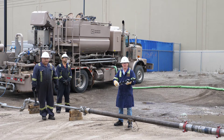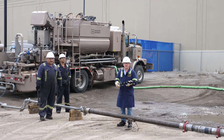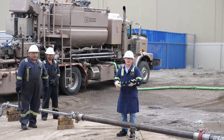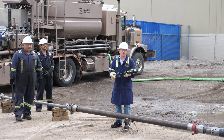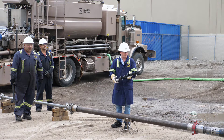So we're going to pump this typical wiper dart through our fixture. In our fixture we've got a couple of our Limitless frack sleeves installed. We have them set up with one brass shear pin in each sleeve, which corresponds to about 250 PSI of opening pressure for each one. We're going to pump a typical industry cement wiper dart through our frack sleeves.